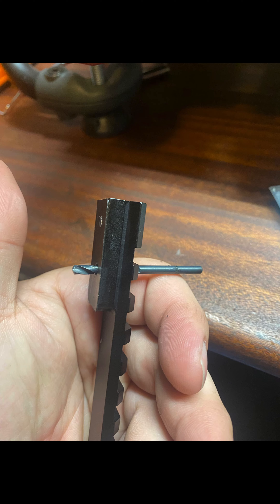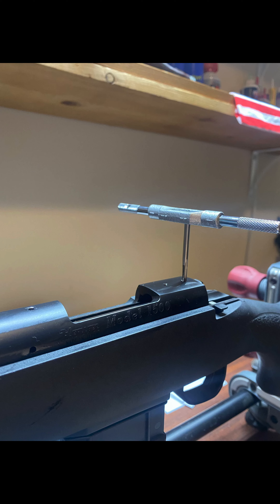Twist a 1/8-inch drill bit through the screw holes to clean up any of the compound and make the hole uniform. This is optional, but you can run a tap through the threads to clean them up and make sure there are no burrs or debris.